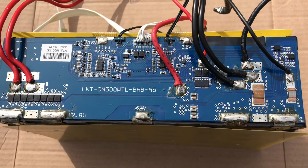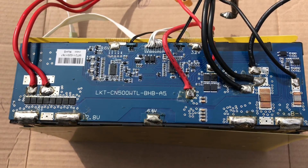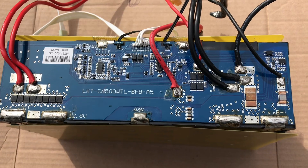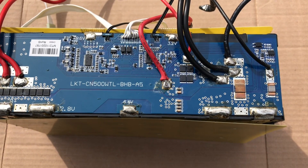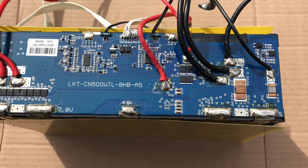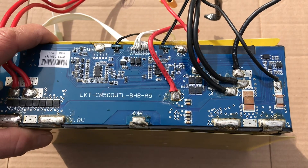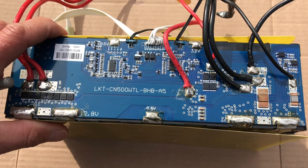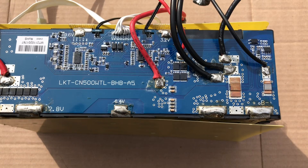So the E1 pulse comes down through just a thin sheet of plastic — it's basically smoked. If you had a glancing blow further out and out of line-of-sight, it might survive, but if you're under the stronger part of the EMP, the BMS is not going to make it. You can use lead acid or AGM batteries, which have better EMP resilience. Or you could take your lithium batteries offline if there's a big threat — Faraday cage them, EMP bag them, trash can method, whatever method works for you.